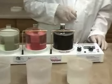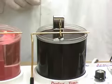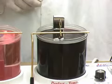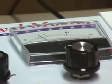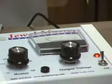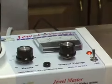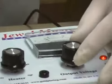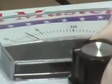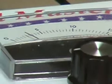After the distilled water rinse, the rack is set into the gold plating solution, hanging it onto the bus. The voltage is again checked. When the rack is set on the bus, the voltage may drop a little. It should now be adjusted to 2.5 to 2.7 volts. If the voltage is too high, it can cause the gold plate to dull and darken.